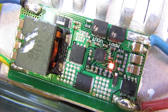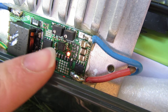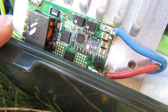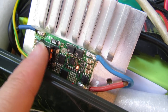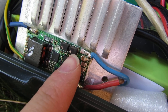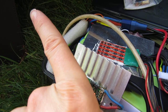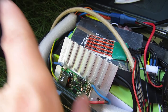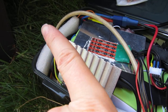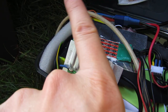So we have the solar going in here and it's a red light for charging. If you read the instructions for one of these, you adjust it to get the maximum power of the panel — there's this curve. You adjust the voltage on it until you get the maximum current, adjusting that threshold on the charge curve, so you get the maximum current before the current drops and you get that maximum output.